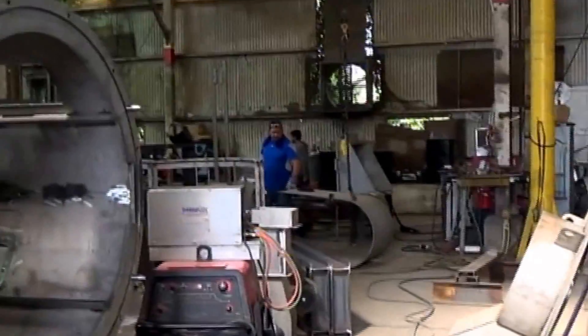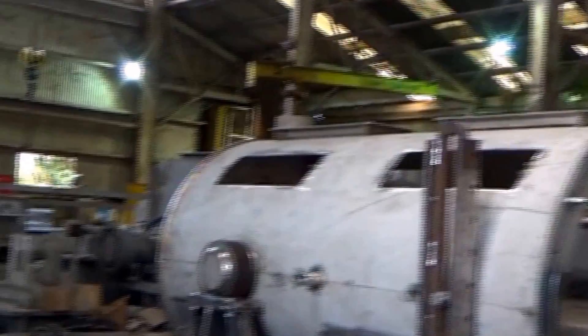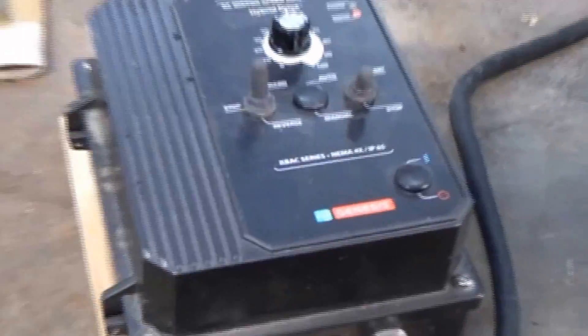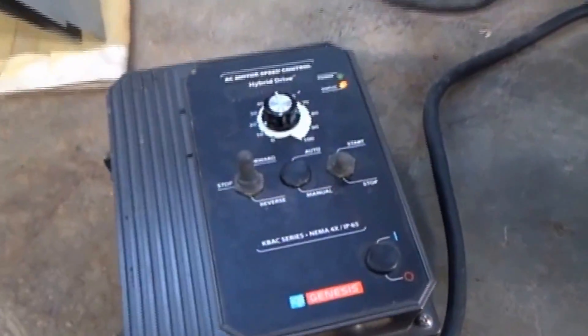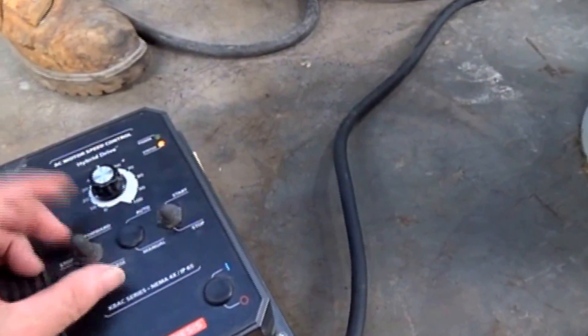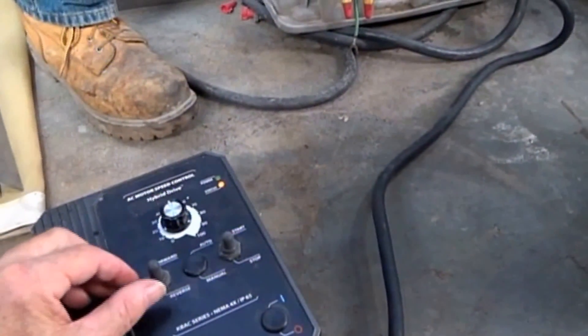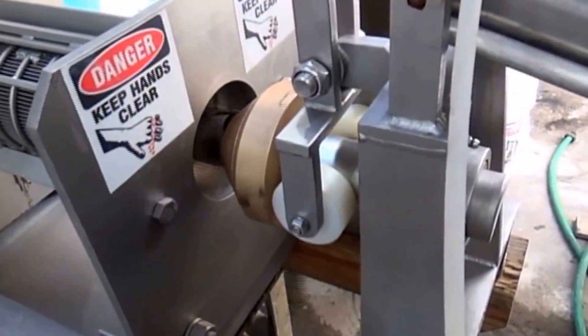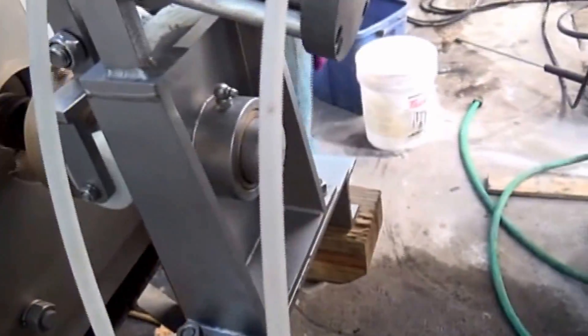Here's something I really like: a conventional outlet. We are plugged in 110-volt single-phase into this VFD, and the VFD puts out three-phase power — 220 volts — to run this little screw press. So if I throw this on-switch, I'm going to hit start and forward, my press starts turning. I've got it set to run at — I think it's about 50 hertz — it's running at 24 RPM.